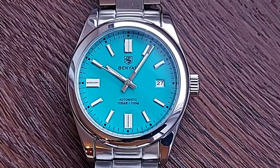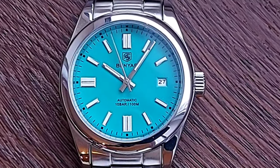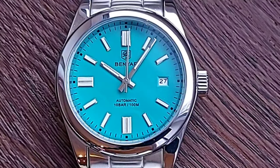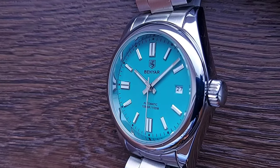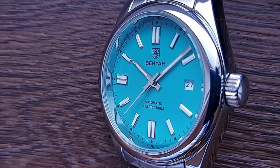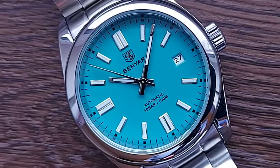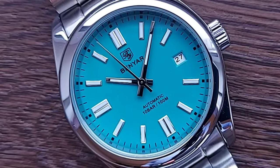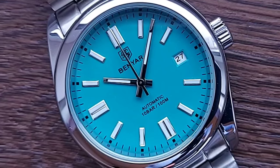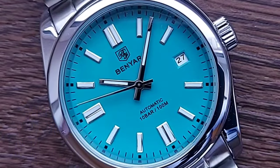The dial texture is smooth but non-reflective. With mineral glass crystal and no anti-reflective coating, there are minimal reflections, yet the smooth dial surface and mirror-like rehaut create some light play. The baton indices are applied, with double batons at 6, 9, and 12 o'clock, filled with BGW9 lume edged in chrome. The minute track runs around the perimeter against the reflective rehaut. The baton hour and minute hands carry dabs of lume, and the seconds hand has an almost smooth sweeping motion.